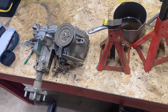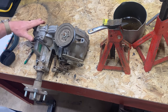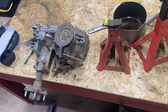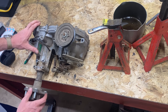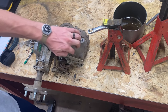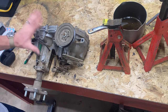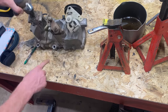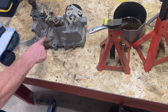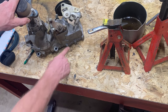I finally got the unit pulled off the John Deere, and we actually have an inverted camera angle to let you see the whole situation here. This here is a non-serviceable Hydrogear, probably an 1800 or 1900 series. The main belt runs a hydro pump in there, which pumps high pressure fluid into the transmission — you go forward and backwards. On the serviceable transmissions, at the bottom you will see a filter where you can actually drain the fluid out. Like you see on this one — it has no filter, it has no drain plug, it has nothing down here.